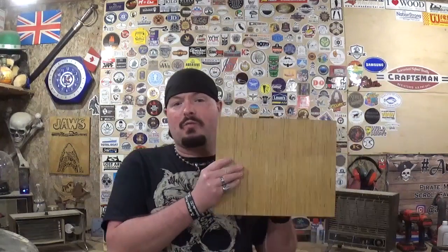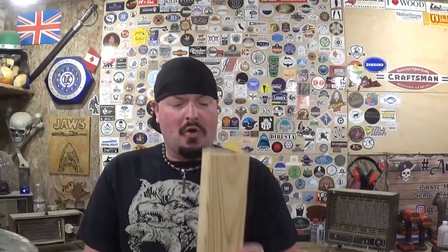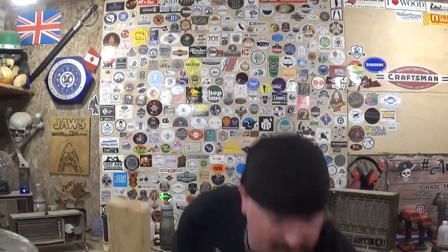I have a very nice scroll saw portrait that I finished a few weeks ago, and I want to add a frame to it and finish it real nice because I'm going to take it in the house to hang it up. I'm not going to reveal the portrait just yet. We're going to take a 2x4 and rip it down to 1 inch square strips to get started on the table saw. I already have a few more strips laying around from previous picture frames and custom key chains I make, just in case there's not enough in this single piece of scrap 2x4.